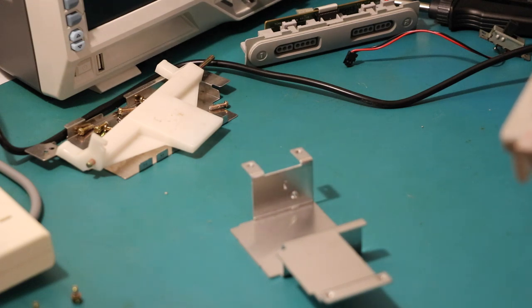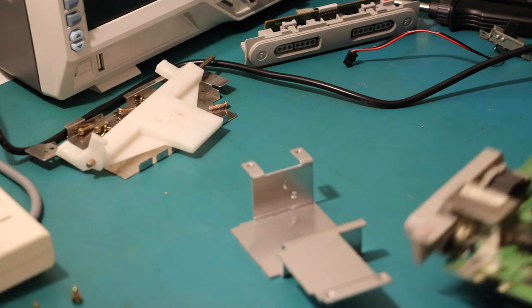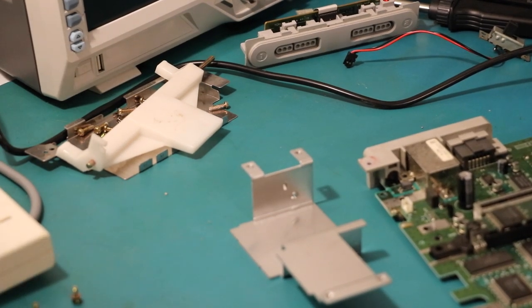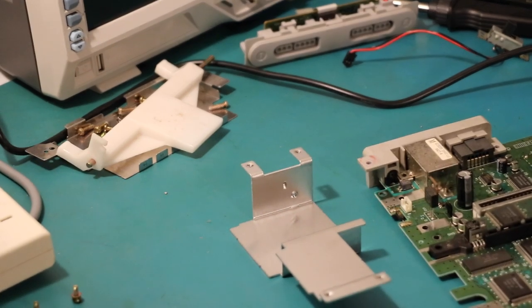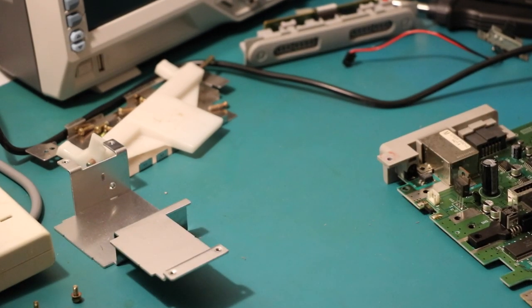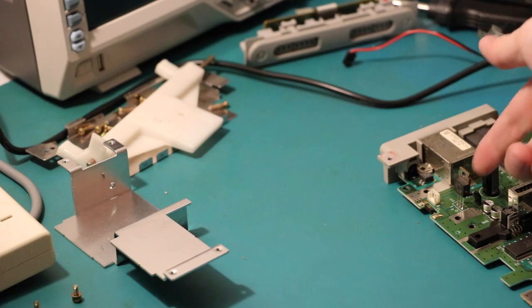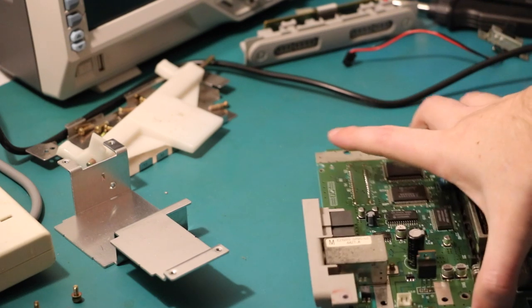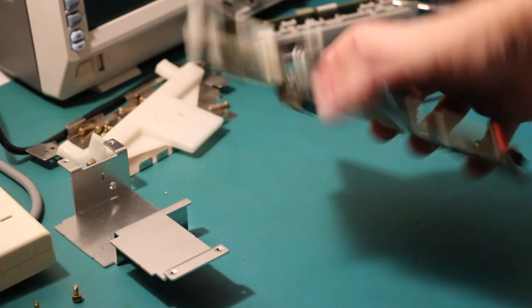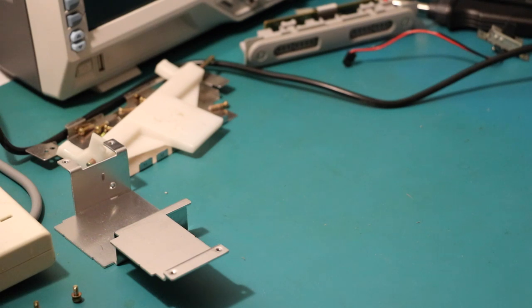So just have a look around, see if you can see any damage to the traces. If not, I'm just going to give this a bit of a dust off, and then we'll desolder the voltage regulator there. One thing I've just noticed is that there is no thermal paste on the back of the 7805, which is interesting. Has it been reworked? I have no idea.